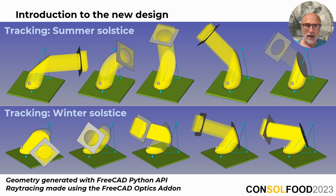I would like to highlight three crucial aspects of our design. Firstly, the aperture area of the collector. The aperture area of the collector is entirely defined by the projection of the stationary reflector in the direction of the incoming sunlight. And since the sunlight consistently reaches the reflector from the same direction, the projected area remains constant, and so does the amount of energy that can be collected.